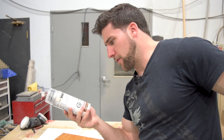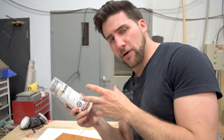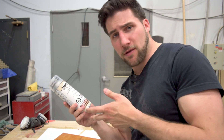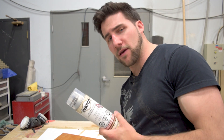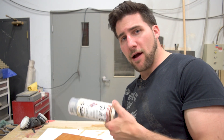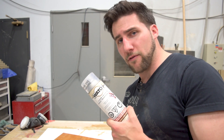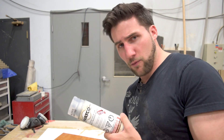So what do you need to know about this? It dries to the touch in about 30 minutes — pretty good, not the fastest one out there. And you don't need to sand between coats because it's a nitro lacquer. You can sand between coats if you want — I recommend waiting a day and then sanding, much like you would when you're outside of your recoat window with a normal solvent-based paint.